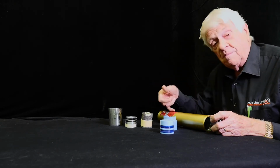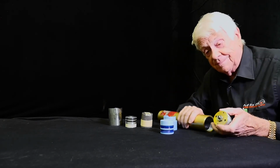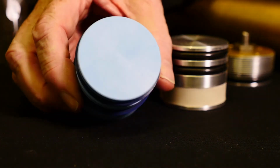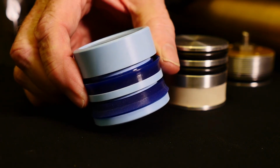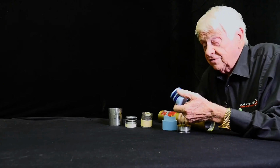And then the piston will travel back and forth just like a spring. That's essentially what an accumulator is. It's a spring. With these seals, the piston shouldn't wear the cylinder, and the seals should not leak. And I would think that this piston in this cylinder lasts the life of the airplane, at least as long as you own it.